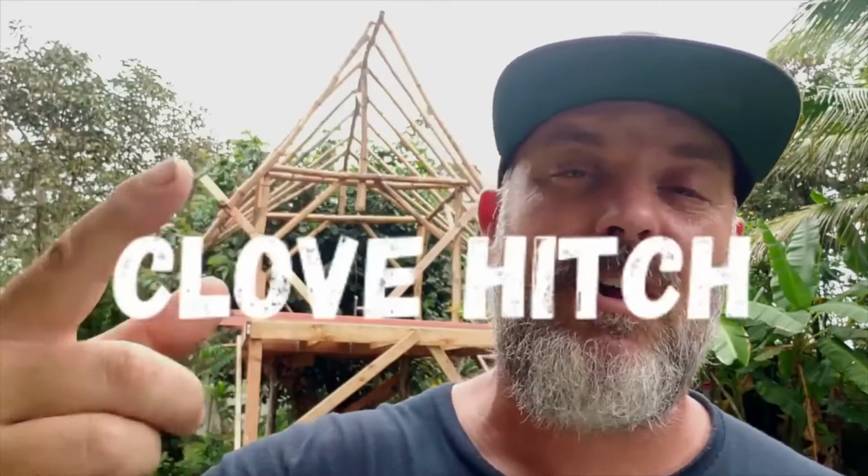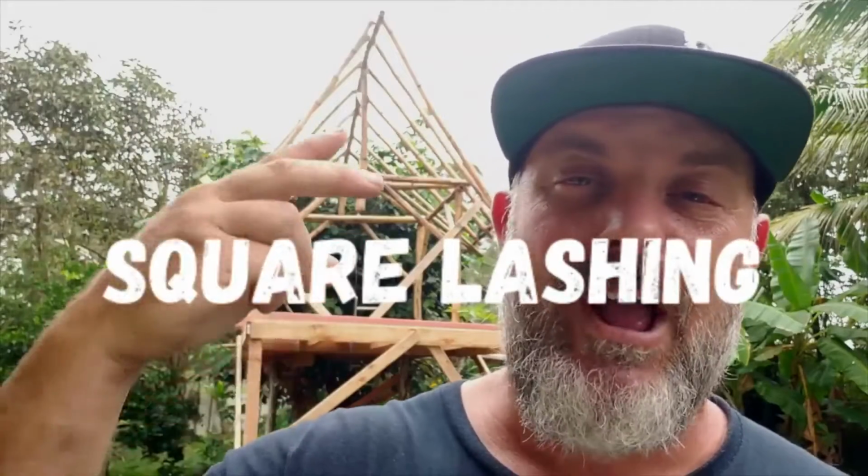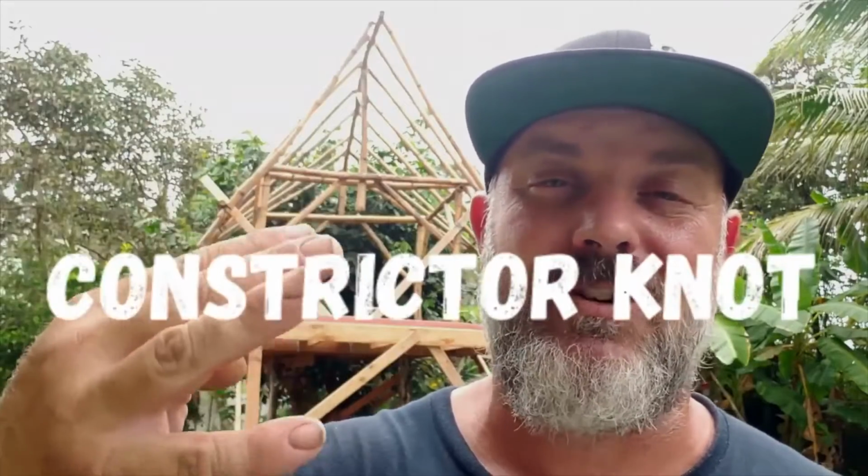We're going to go over a clove hitch. We're going to go over square lashing. We're going to go over Japanese square lashing. And we're going to go over a constrictor knot. These 4 knots are commonly used when building with bamboo.